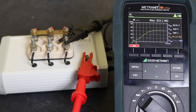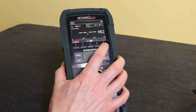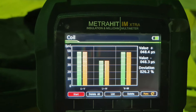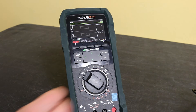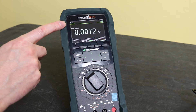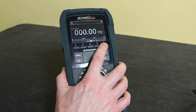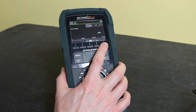The coil test displays a microsecond value and measures 10 to 250 microseconds with an accuracy of 10% + 5 digits. Switching over, the meter defaults to AC volts; pressing the function button cycles to Hz, then duty cycle, then speed (RPM), then a VFD mode with filter, and back to AC voltage. There is also a relative/zero function for AC, plus manual, auto, and data modes.